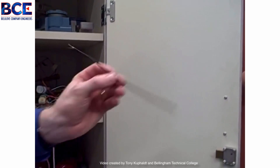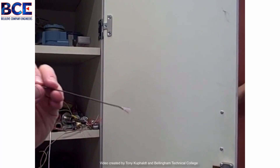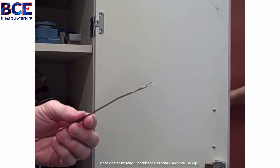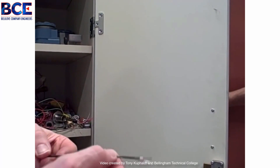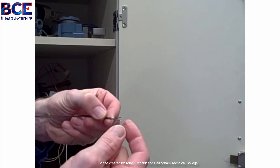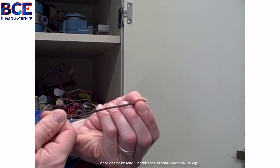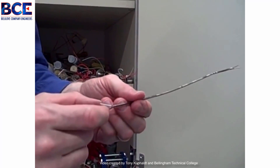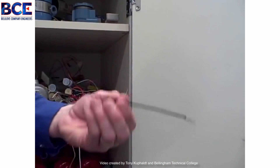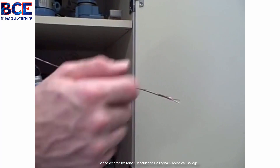What we're looking at here is a piece of thermocouple wire. This right here is type J. We can tell that from the color code — white and red — with red being negative and white being positive. This is thermocouple grade wire; you can tell that from the brown sheath. If we simply took these two wires and twisted them together, spot welded, clamped, or silver soldered them, that itself would form a thermocouple junction. We could then connect the other two ends to a thermocouple instrument and have ourselves a working sensor. It's nothing more than a pair of dissimilar metals of specific type joined together to make a junction.